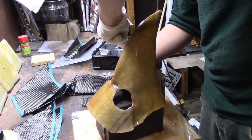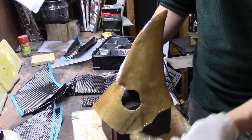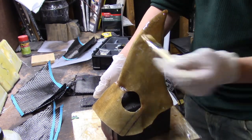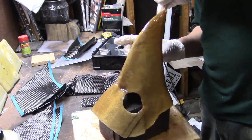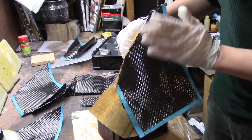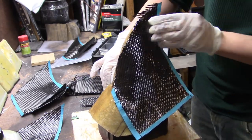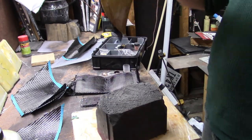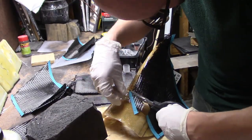So next up, after I did these layers and cleaned it back up, was on to carbon fiber. Now carbon fiber is an amazing fabric to use, but it can be quite annoying because it's very stiff. I was using plain weave and some tighter weaves. I'll put in the description a link to all the different materials I used that you can look up and buy yourself. If I had the opportunity to pick up maybe some satin weave or something along those lines, it would have molded to the beak and everything a lot better. It still turned out remarkable.